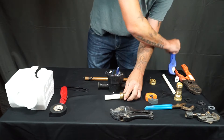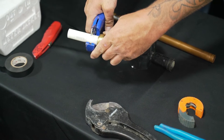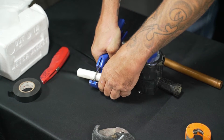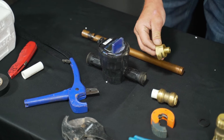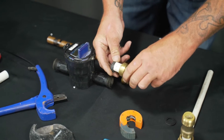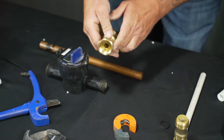You'll start by getting two 3/4 inch SharkBites and inserting 3/4 inch PEX inside them. You then want to cut the PEX leaving about an inch of line left. You'll then want to put a crimp ring on the PEX line and insert your meter fitting.